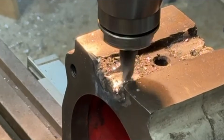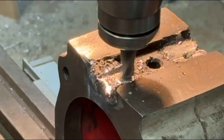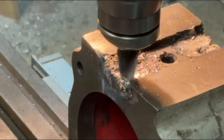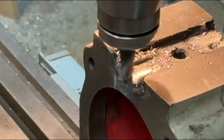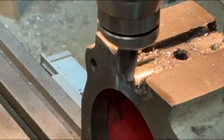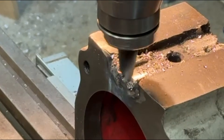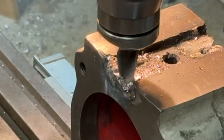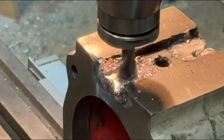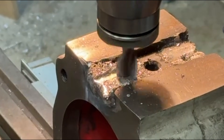So just take this very carefully, don't take too big a cut, and hopefully the cutter will last. It takes quite a lot of wear out of the cutter itself when you're machining something like this because it's so erratic and intermittent cutting - which is never good at the best of times, especially when it's got hard spots in it like this. Obviously in the welding itself, it tends to harden up the steel and put hard spots into it, which tends to wear the cutting edge of the slot drill. But we're getting there, I'm almost there now.